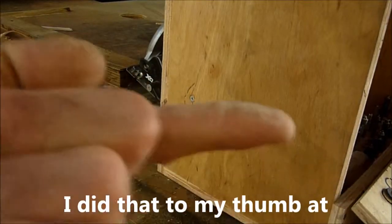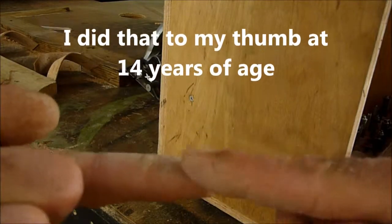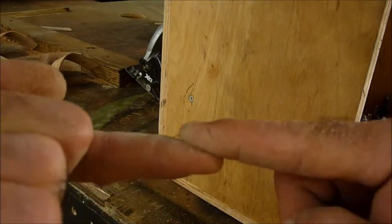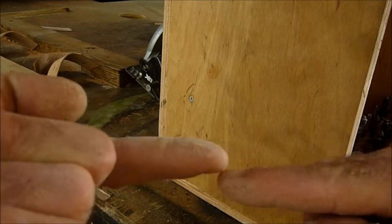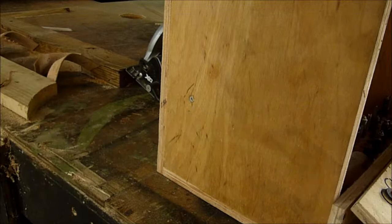And it's not going to be glued because that wood is lap joined together. It's a series of four pieces. Lap joint is where one piece is notched out. Like imagine a notch taken out of that finger and another opposite notch on this finger, which allows them to join perfectly flat, but their glue surface has been increased.